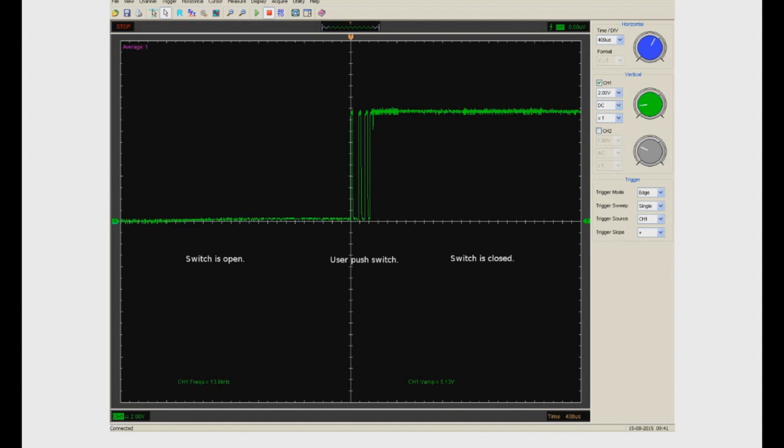As you can see here from this digital capture from an oscilloscope, this example of a switch button was, at first, not providing power. Then the switch was pressed, and for a brief moment you can see the power was delivered, then it turned off, then on, then off, then on, and off, then on, off. This can sometimes be interpreted as noise on the circuit, causing a pop.